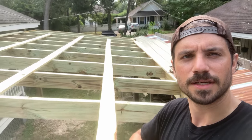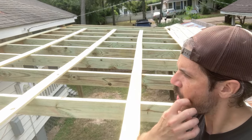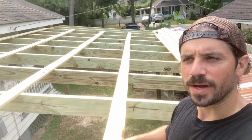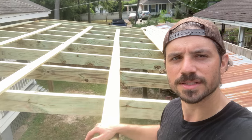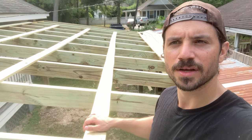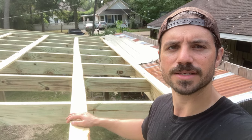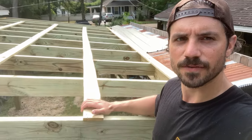Next up is the purlins, which are the horizontal roof slats, and I'm spacing those two feet apart. I'm getting on top to get them spaced evenly and start tacking them down. The majority of my purlins are now installed except for the very end. Since I'm working the metal roof starting on one side, I'll work it down so when I get to the end I'll know the exact length and can cut those last purlins to fit just right. There's going to be a little overhang — these are 12-foot sections on a 20-foot span — probably hanging over about six to eight inches on one side, with about four inches on the other side as a drip edge.